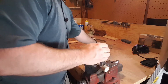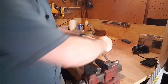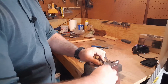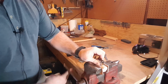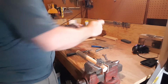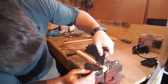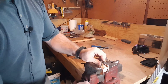it should work. Using one that I've already bent, I'm going to put them both on this dowel, nice and tight together. And from there, I'm going to get my measurements for the holes that I'm going to drill here shortly. Axe head up. I actually don't want any metal in contact with the wood, so I'm going to drill the holes. Actually, I'm going to spread this conduit apart a bit.